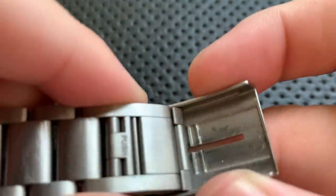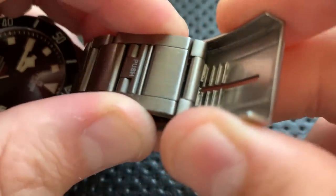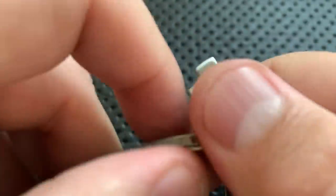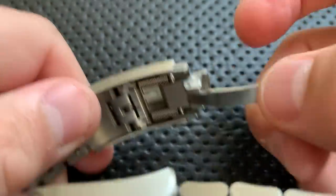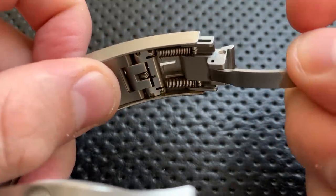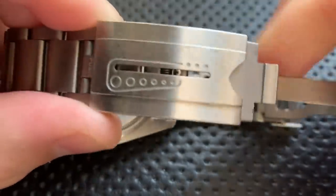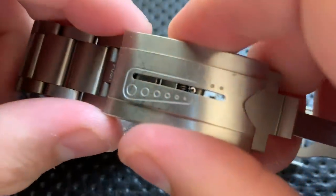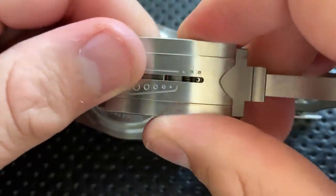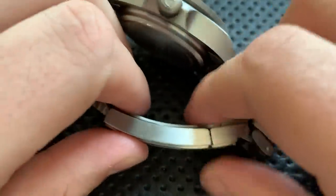The clasp includes a tool-less quick adjust system. Underneath, there are little tongues that fit into any number of grooves. Past a certain point, you go into a spring zone — all that's in control are two springs. When you pull the bracelet out, the springs pull it back, maintaining spring tension as you wear it. It keeps going until it hits a stopping point. This is essentially an infinite quick adjust that's always kept tight, with the option of three fixed positions as well.